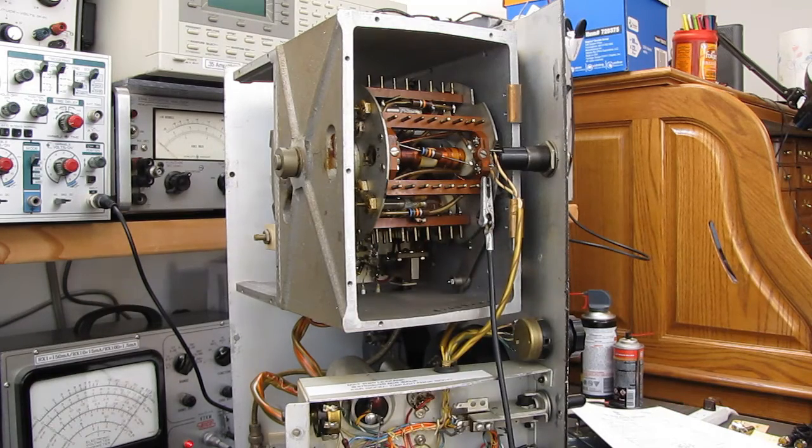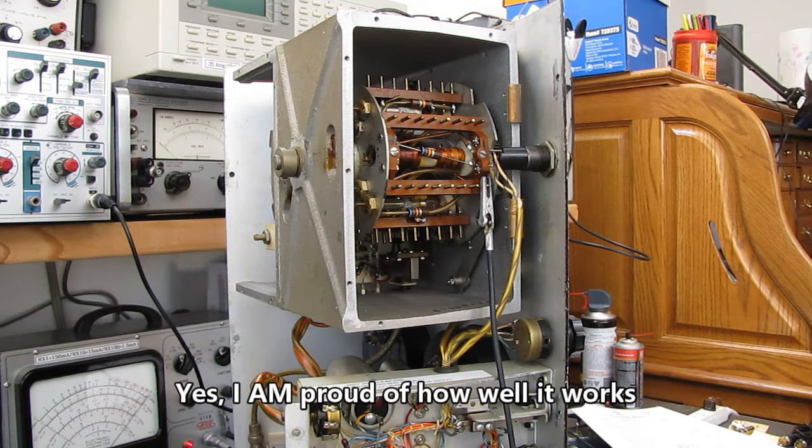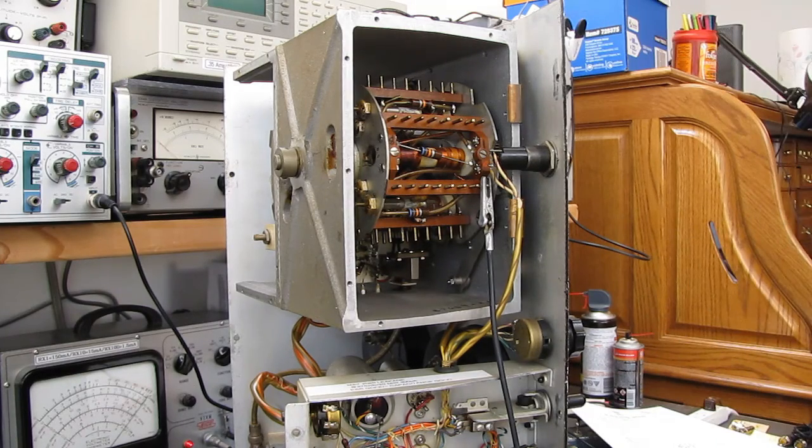On the money. And before anybody says I can't be that accurate with this voltmeter, I put the resistors in it. They're better than 1/10 of 1% on the resistors. I sat there for hours with a very, very expensive Hewlett-Packard ohm meter that goes out to milliohms, mixing and matching series parallel resistors when I rebuilt that VTVM. And that thing is just about as accurate as you can get until you get into a digital meter. Okay, the 688K is good. Let's put an orange line on that.